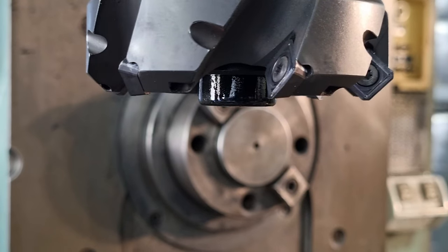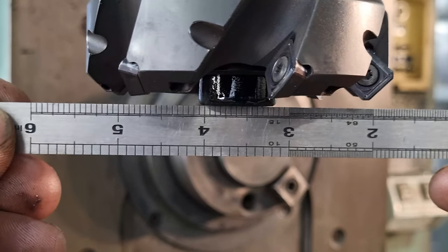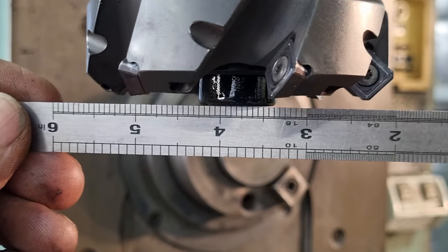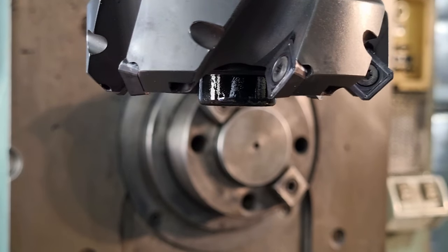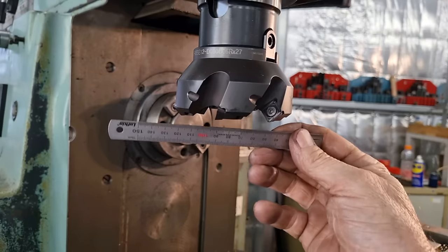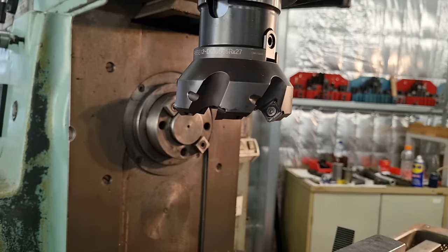So I was just looking at this cutter. It's a new arbor. And I've noticed the mounting cap screw sits lower than the inserts. Well, that's generally never a good thing. So let's rectify either the cap screw or the washer. Oh, that was easy. I just used the mounting hardware off our arbor from the horizontal spindle. And yeah, it tucks up inside nicely. Just something to be aware of.